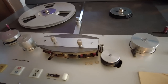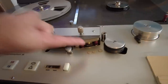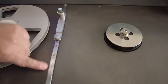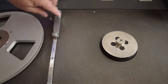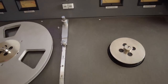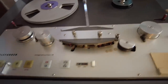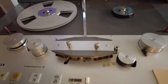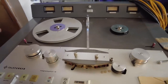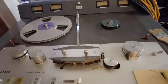This doesn't have a preview head... or does it? It does. It works in a different way: you load the tape here, and that's the preview head, that's the playback head. You load the tape there and then pull the tape. You can see that's for 7.5 ips, 33, 7.5 ips, 45, 15 ips, 45. I've been to a lot of mastering places and I've never seen that ever. This is the only way Telefunken - or AEG, who was the manufacturer - did it. I've never seen it on another deck. How does it sound? Absolutely fantastic.